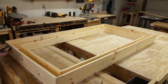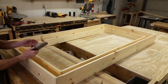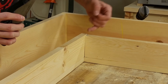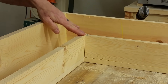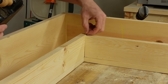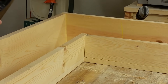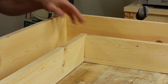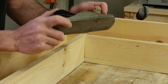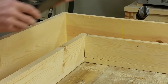One of the best things you can do if you're going to be doing any kind of woodworking is pick yourself up a plane. This one only costs about ten dollars. I do not want any kind of gaps around the corners. It doesn't have to be perfectly flat - I'm going to aim for flat and whatever I get, I get. I don't want any sharp gaps where I'm going to be getting light or air in through. I just want it to look nice and flat so when I put the plywood down you won't be able to see any of it. These are only about ten dollars - I got this one at Menards - and they're really worth it for little things like this.